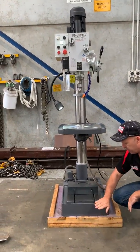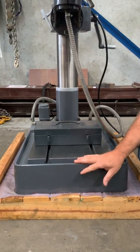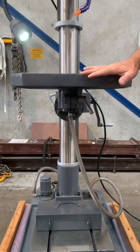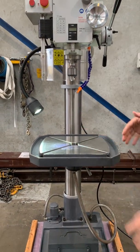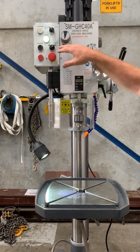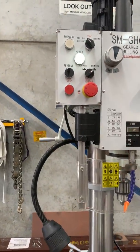Overviewing the machine: there's a heavy duty solid base which also holds the coolant system — coolant runs down and then pumps back up. There's a T-slotted table which can be rotated left and right and also swung out of the way so you can use the base. Up on the head, we have a drilling feature and a tapping feature, which we'll run through shortly.